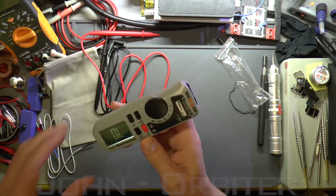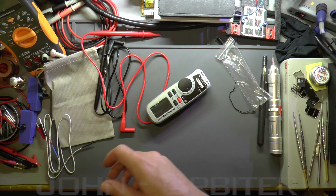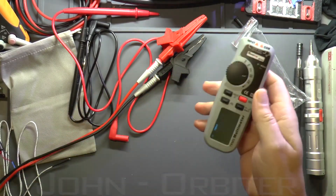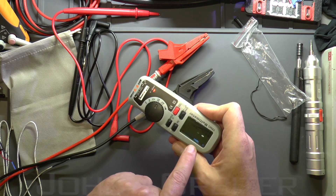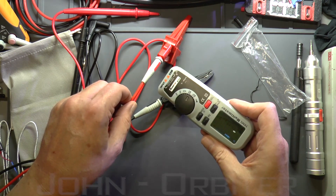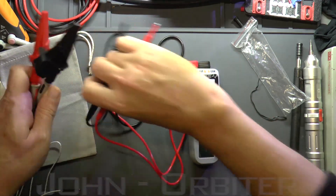I'll test the voltage alert setting — press and hold for voltage alert, turn on the variac and bring some mains over. I've got about 100 volts on there. You can see it's detecting it — the little red light flashes on the front and it flickers in the display. It goes up with the voltage. This live mode helps determine whether something is live or neutral.